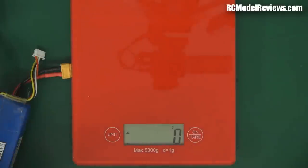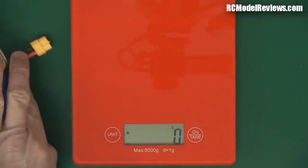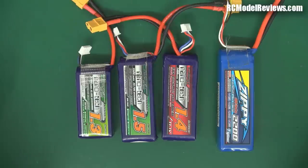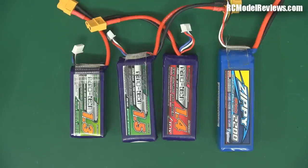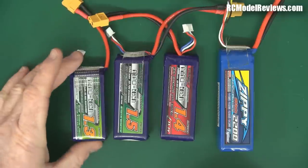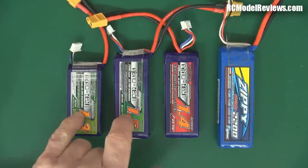It's well worth waiting. Whatever you do, don't bother with the little Zippy compact 1200 or 1500 batteries - they're rated to 35C but they just don't stand up. They're really not a 35C battery at all. The voltage sags so quickly it's really annoying. Your voltage alarm will be going off right from the time you lift off the ground. These batteries all come from Hobby King - the Turnigy or Zippy batteries. I see people advertising 1300s or 1500s in local New Zealand shops wanting almost $50 for one of these. These are really reasonably priced from Hobby King, and I find it pretty hard to go beyond these for value.